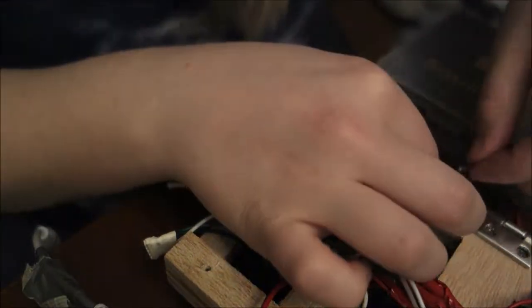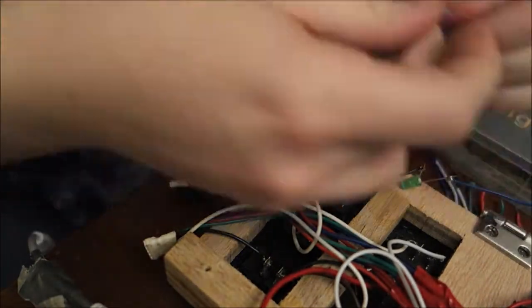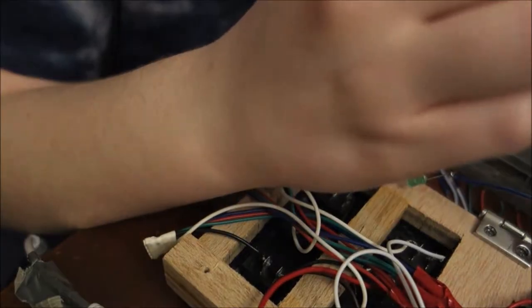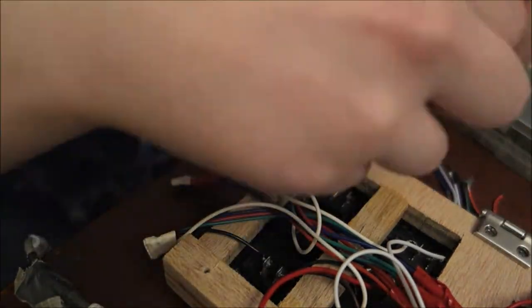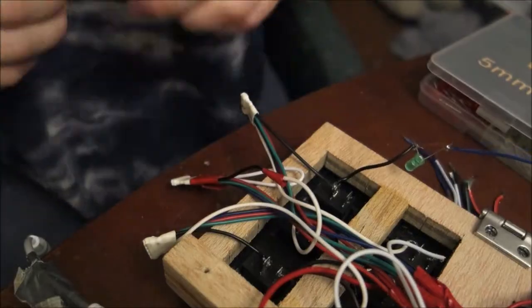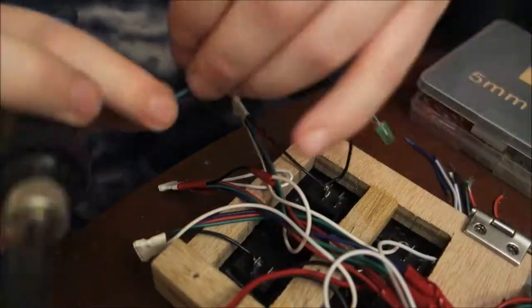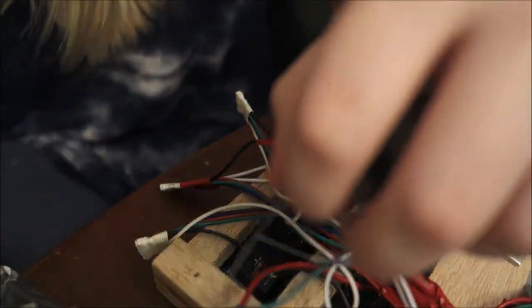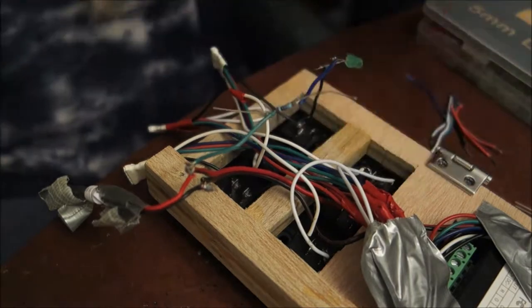So we're starting out with the 3 bottom ones. We have these as green diodes because they're just the power for the left and the right lights in the back, and then the TV up in the front. So we're gonna wire the LEDs directly to the negative port, and then we're going to wire a resistor between the LED and the positive port, as the diagram explained.